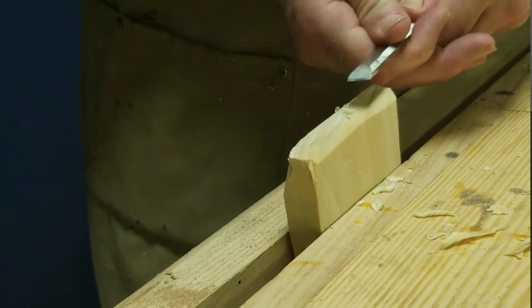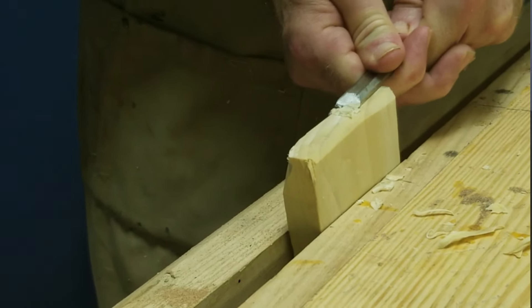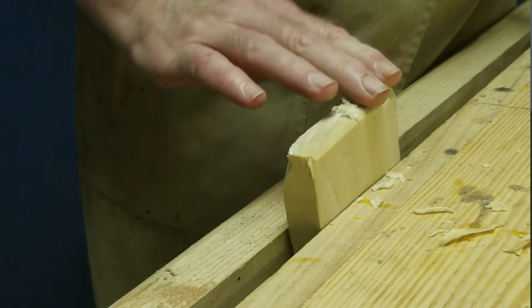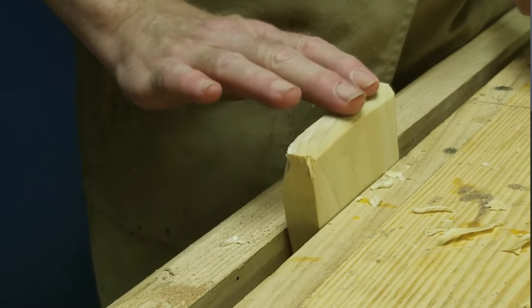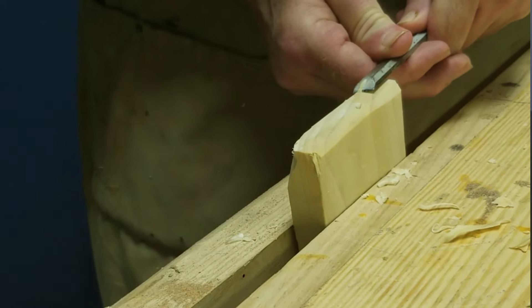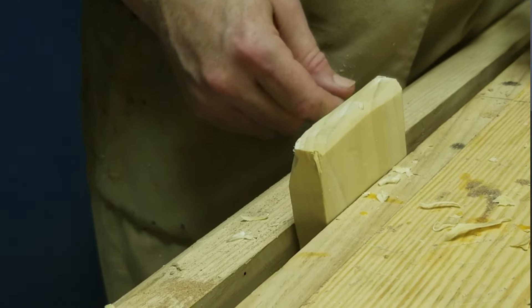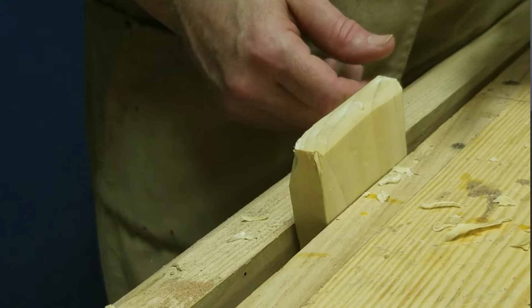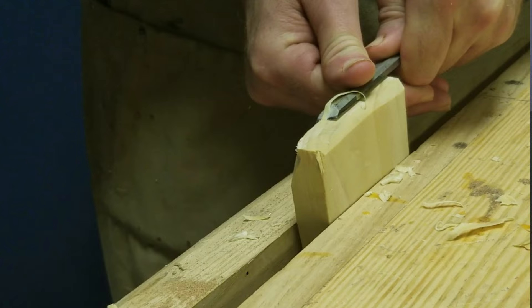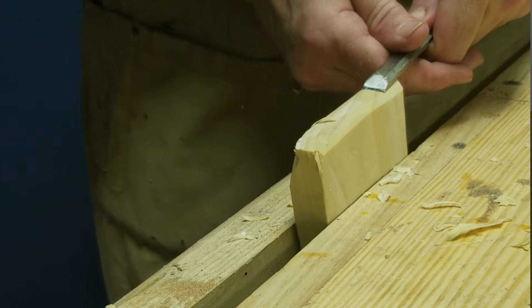In difficult grain or reversing grain, you can even do some simple, almost stabbing-like motions. If you've got a good sharp chisel, that is going to leave a beautiful surface on the end grain. I'm not going to give tips on sharpening as I don't think I'm good enough at it, but I'll leave some links below of some videos and people I think are good at sharpening. When your chisel is sharp, you just get some nice, nice shavings.